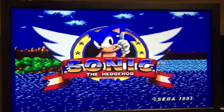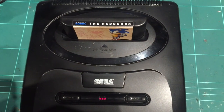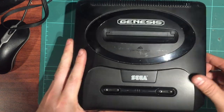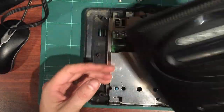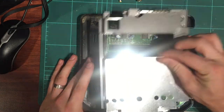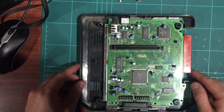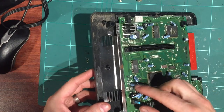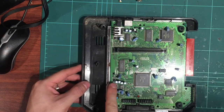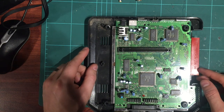That's really odd. Okay, let's open it up and have a look - could be a number of things. I've turned it over and pulled all the screws out, so let's lift the case off. It's very clean under there. Screws are all out from the RF shield - pull that off and put it aside. Now let's have a quick look for any signs of prior work. We've got some mismatched caps here - they're all blue except this one and this one, which may have been changed.